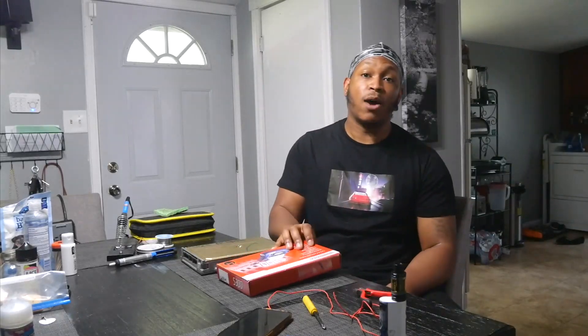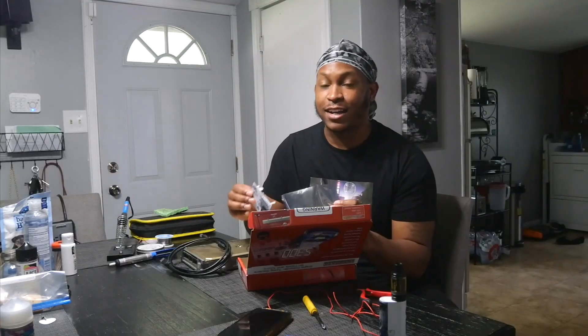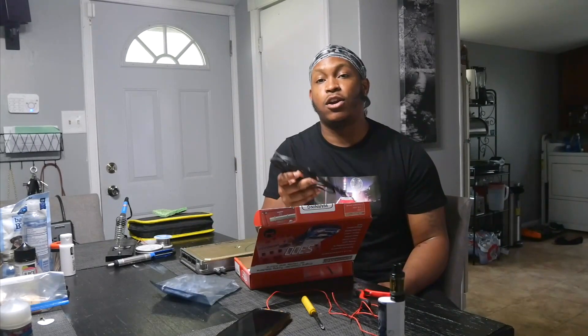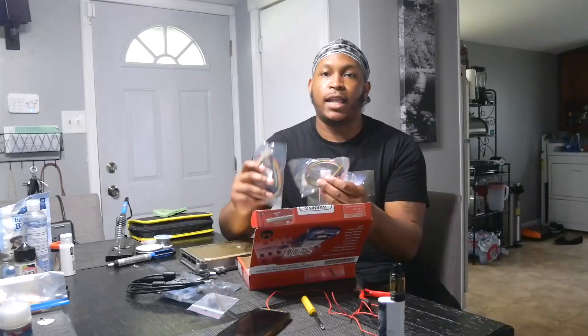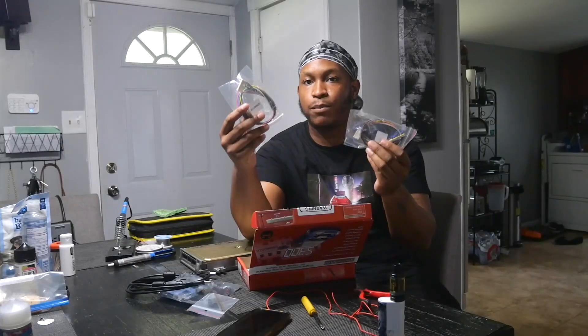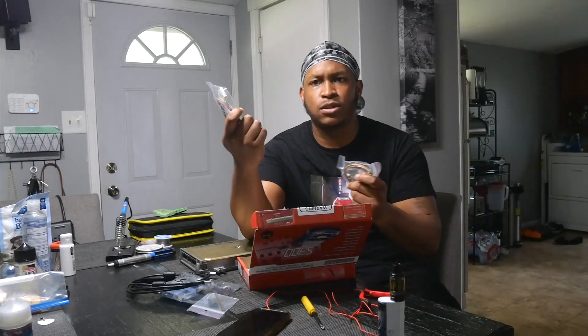This is what's going to allow the Prelude to make some power because I do plan on turbo-ing it pretty soon. Now there's a few things that come with Hondata. First thing you get is the actual chip — this is what gets socketed to the ECU. It also comes with a USB cable so you can connect it to your laptop. You will need a Windows laptop. You also need a copy of S Manager — I'll have that in the description below. It also comes with a new ROM chip, some pins, a jumper, and a resistor to install on the ECU.